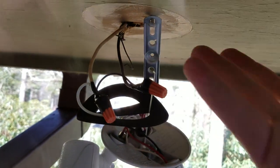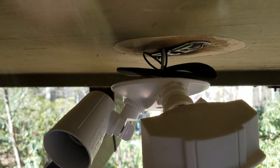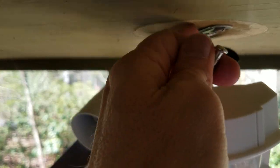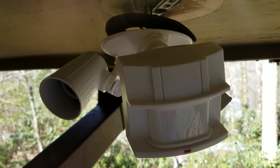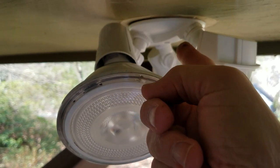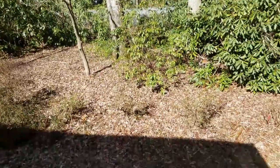Wires are concealed in the ceiling, the gasket is in position, and the two screws to hold down the bracket are in position. All I have to do now is use the long center screw, which goes up the middle of the base and through the bracket to hold the whole thing in place — and the gasket will make it waterproof. Make sure you orientate this the way you want it before you screw it down. The plate is mounted. I still need to put in the little white plug that comes with the kit so no moisture or bugs can get in. I have one light going towards the driveway and the other towards the walkway.